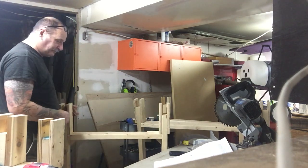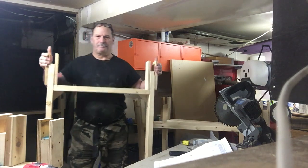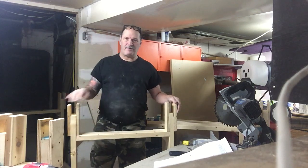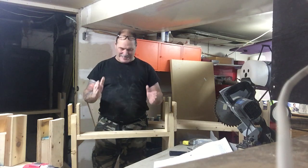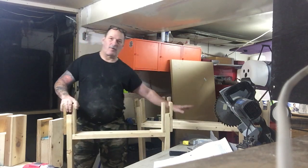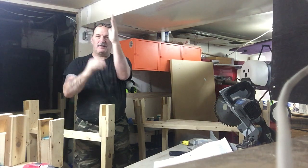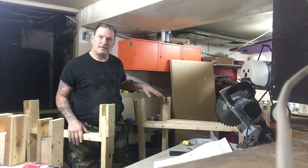Now this is stand number 3. This one's 29.5 inches wide. Okay, so see if I can show you this here now. The smaller stand that goes in front of this stand, the strong back is going to ride right inside here. It's going to go from the narrower stand inside this stand. So the 2x8 strong back here will actually go back and ride inside the 33-inch. So they're all the same height. They're just stepping in from the front single to a double narrow, and one more time going to the inside, the 33 for the stern.